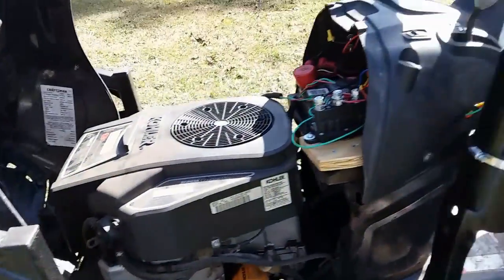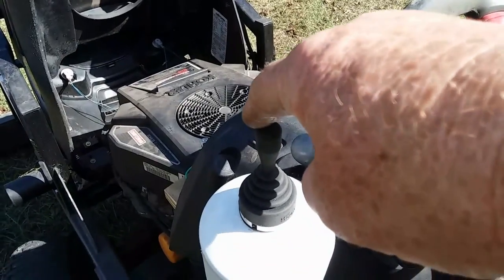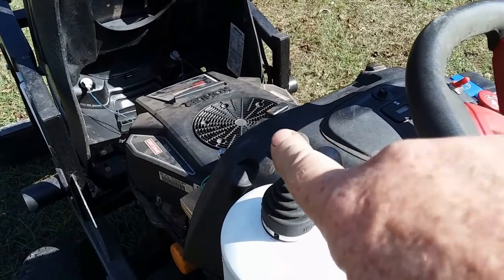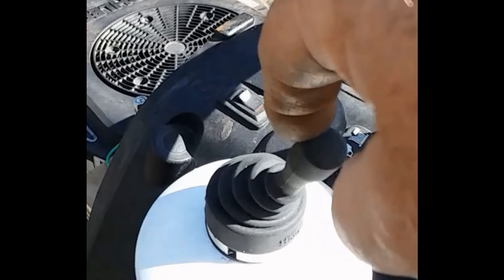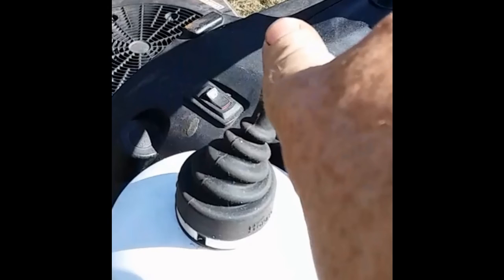Another actuator on the other side. This joystick is a four-position joystick. The way I have it wired is: when you pull back on it, it lifts the arms in the front. When I push forward, it lowers the arms — lowering the overall bucket down to the ground. When I push it out away from the steering wheel, that pivots the bucket up. And when I turn it towards the steering wheel, it empties the bucket — twists it down.